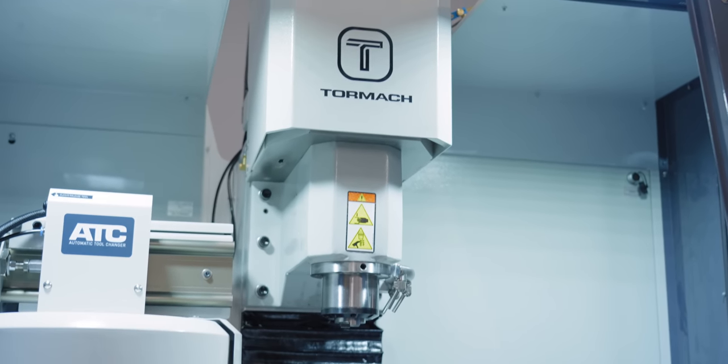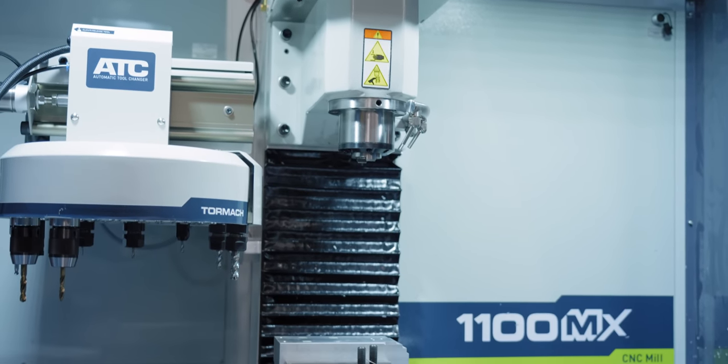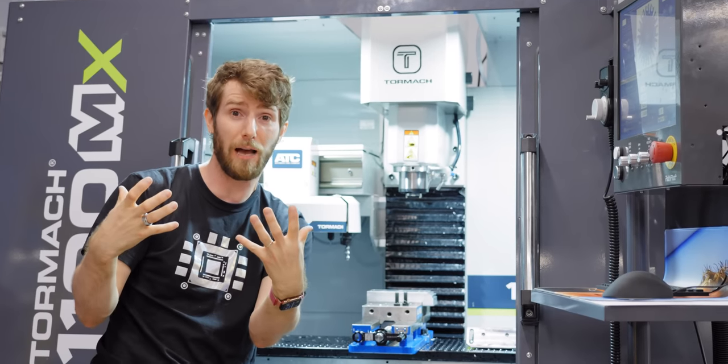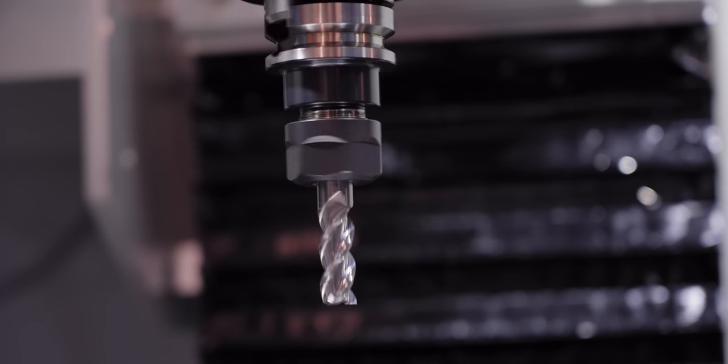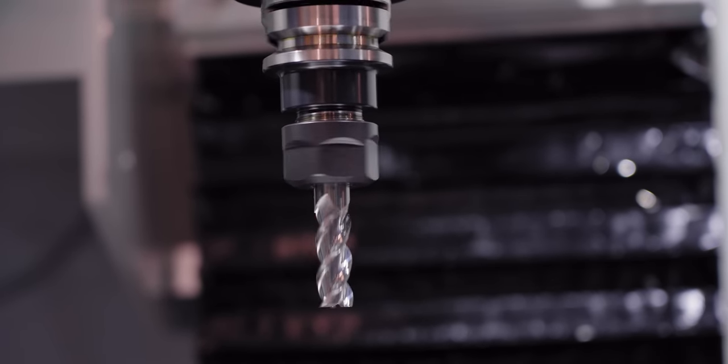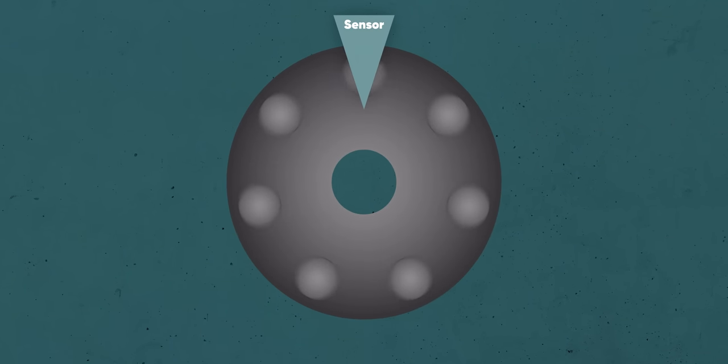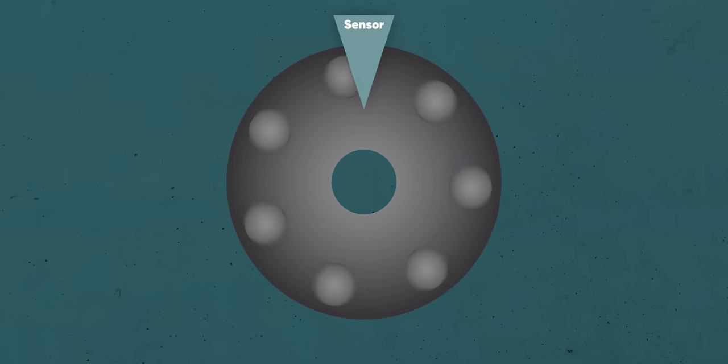I actually lied a little bit. This one is not technically a servo motor. It does have the same magnetic array and the same Hall effect sensor that allows it to know exactly how many times it's spinning and where it is. It's just that it sends that raw data over to our computer to process rather than having an onboard encoder that sends it out. Sorry.